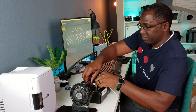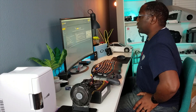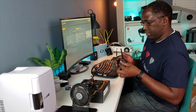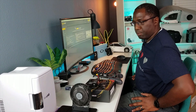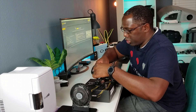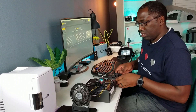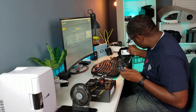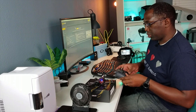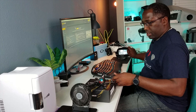Let's unplug the USB. I'm going to make sure the arm switch is set correctly by plugging in a battery and seeing if the motors spin up. This is the reason you don't want props connected at this stage. The arm switch works — it's in the right configuration — and I do have a picture in my goggles. Let's unplug the battery.